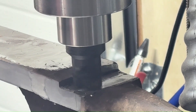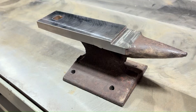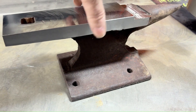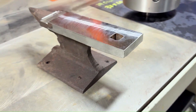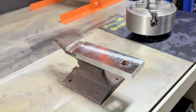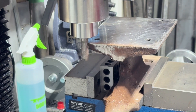My only guess is it's just too much resistance on a small machine to cut, but it's actually not cutting that deep. You can see when we take it out that it is milled, but there are some rather deep cuts going across the top. When I say deep cuts, I mean deep for a finished milling job. The one-inch cutter came out so much nicer. I showed the owner what was going on and asked where he wanted to proceed.